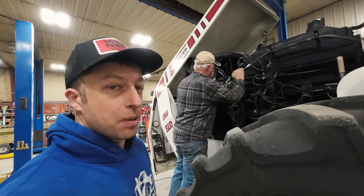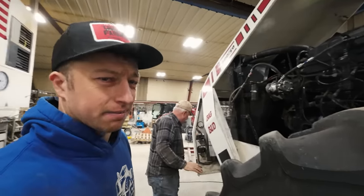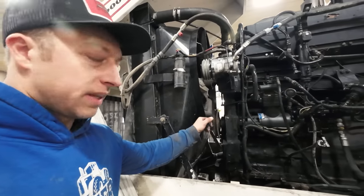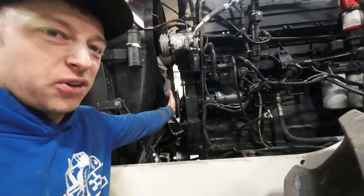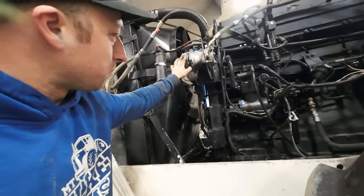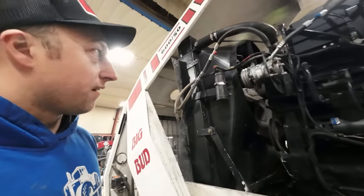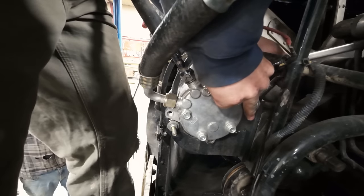Yeah, now we're gonna look at that AC pump, see if that bracket leg arm's made. It's just like I threw the level up to it, the straight edge, flat against the face of this pulley here, and it comes out a little just left of the inside of this belt pulley right there. We're not running two belts, we're just running one. And that little bit offset's enough to roll the belt and then cause it to kick off. So I think it needs to come off and we gotta true it up. Nice and tight.